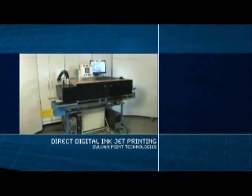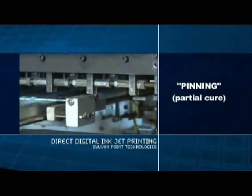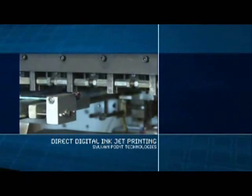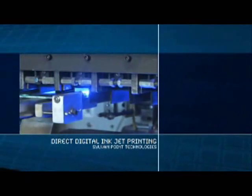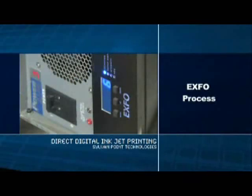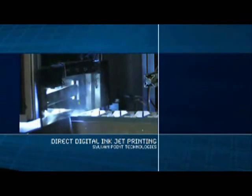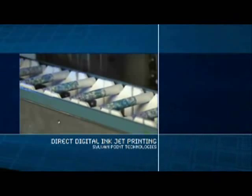The surface tension of many products being decorated requires a partial cure of the ink immediately after printing each color. This is called pinning. Pinning holds the dot pattern in place until all colors are printed, using ultraviolet light emitted from LEDs — a new EXFO process. Finally, the pen is rotated under high-intensity UV light, instantly curing the inks. Pens are then placed back onto the conveyor, then dropped into a carton.